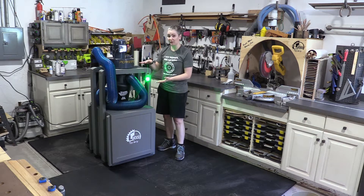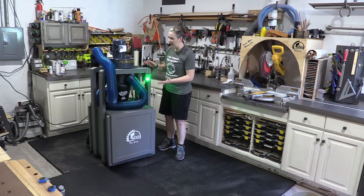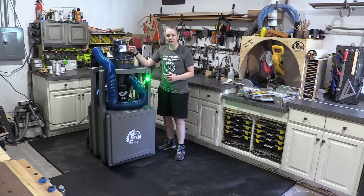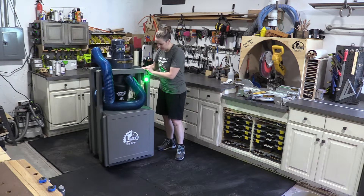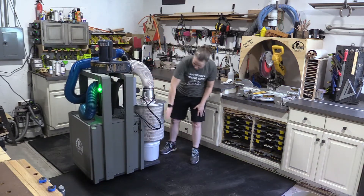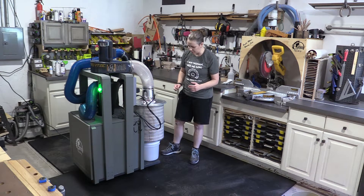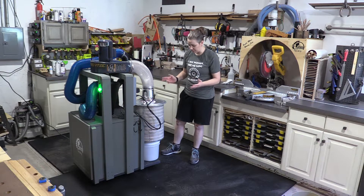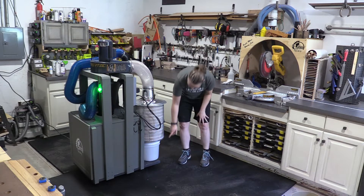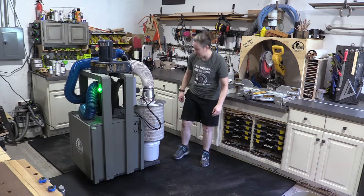I'm trying to keep this as short as possible because this is going to live over by my clamps, so everything was designed to try to make it as short as possible. I picked up this used 1-horsepower Powertech motor for $90. Using an air filter that would be for a big caterpillar — it was also cheaper, so that's good. I'll put a link in the description to this filter. I was extremely happy with it. I have an easy twist-off bucket on the bottom, so I'll show you how I attach that.